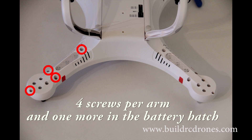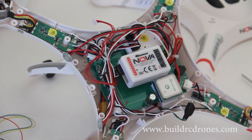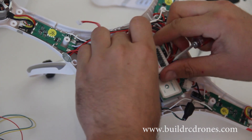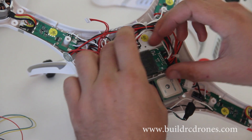So basically here I'm showing you how to take the top of the unit off, which means unplugging the magnetometer and unscrewing some bolts. The flight controller case is just a snap fit, but the injection molding probably wasn't quite what they expected, so they actually put a zip tie all the way around it to ensure that the flight controller won't pop out of its case — so you need to remove that.